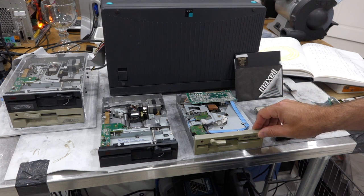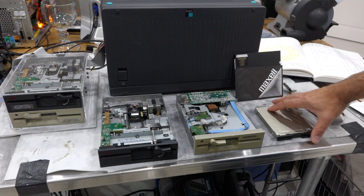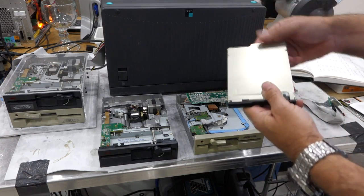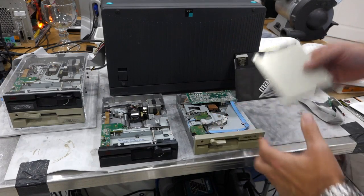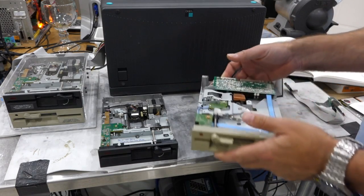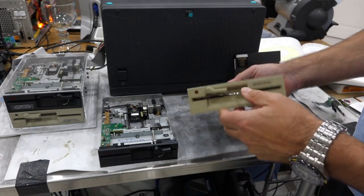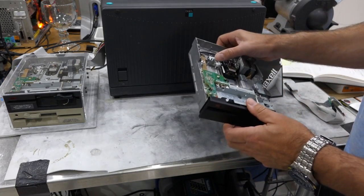The first problem is that floppies are unbelievably unreliable. It's not only the mechanical parts or the heads that go bad — those are easy to clean — but three floppies I tried to hook up to the system were bad. The original floppy in the Dolch had bad electronics and a disk fail error. The first five and a quarter floppy I tried reads correctly but writes at the wrong density, so there's something wrong with the density selection. The heads are perfectly fine.